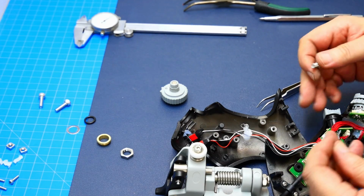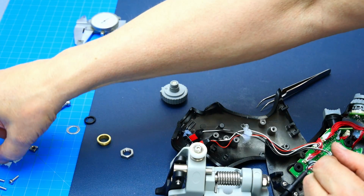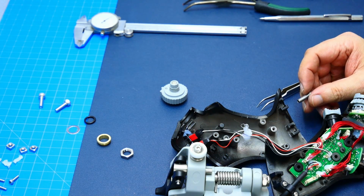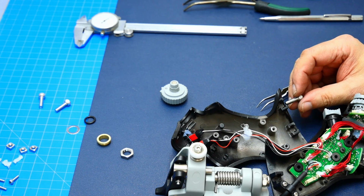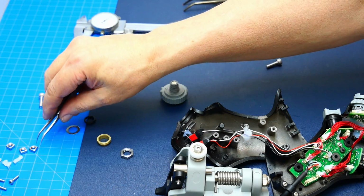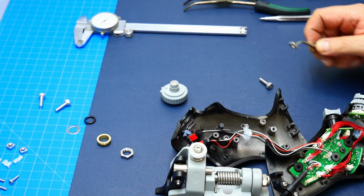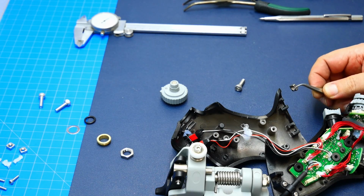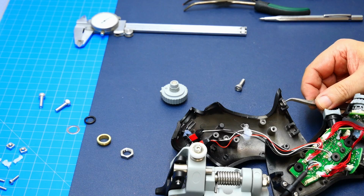So, you know, it's a simple way of doing it, and maybe it's even a smart way of putting a little spot of hot glue, because the hot glue will come loose once that screw centers. So it's not intended to hold that nut permanently in that position. That bolt here will do that job. This is just made so that when you assemble it, those nuts don't fall all over the place.